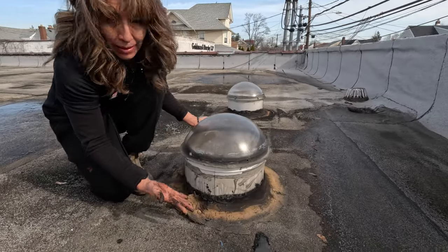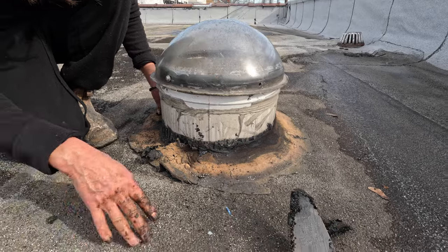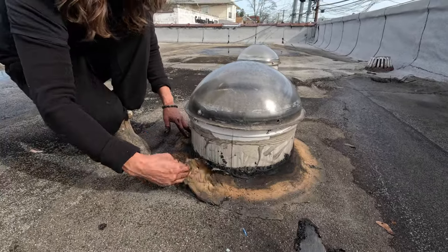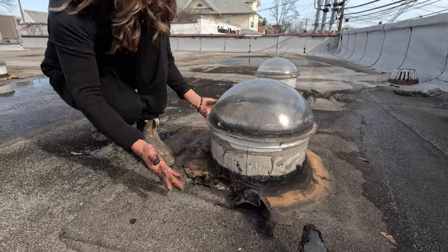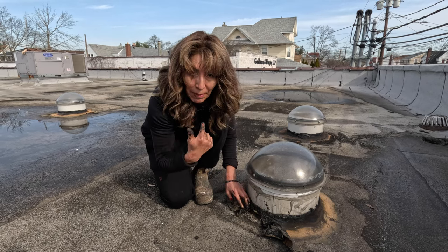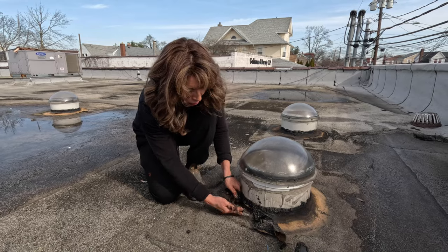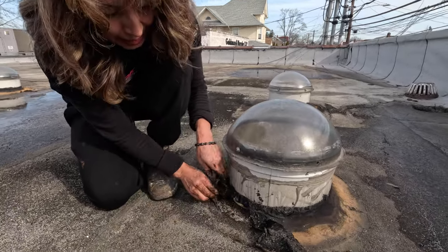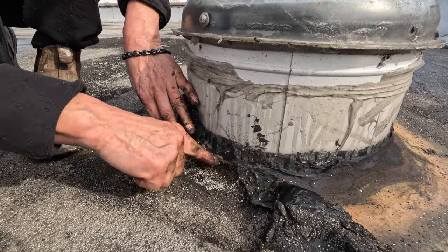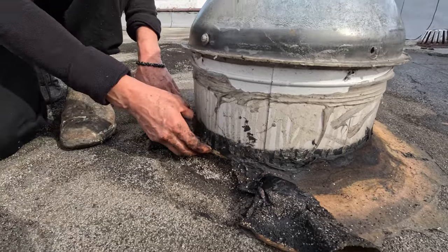Very nice, and I never believed there's a leak here. I know it's a leak inside the building, but see how very nice, and people put more tar or whatever. See, it's tar, and we think, oh, it's nice. But the important thing here, always, always, it happened to me when I was learning. I said, no, it's not a problem. This is not a real problem. When you start looking, it's not sticking to the membrane, and that's what's wet here, the water. So the water goes through here, and goes inside the building. So this is very important preparation, okay?